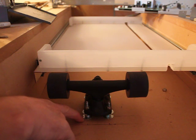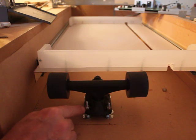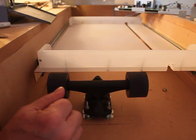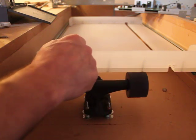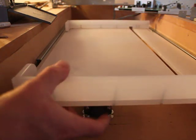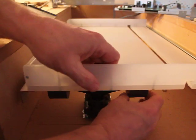Underneath here are blind pushing nuts — I'll show you pictures of those in a still picture. There are some springs underneath there to give some upward pressure, and then here are the nuts, which are the same nuts we've been using the whole project, that lock down. So you can adjust it up and down to get your perfect fit. As you see when we put this up here, it's very free-rolling and you cannot stop these wheels. Once you engage them, they're tight.